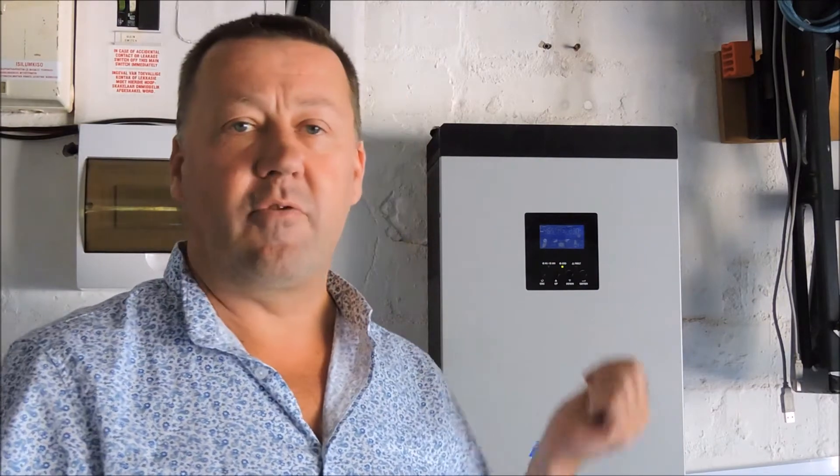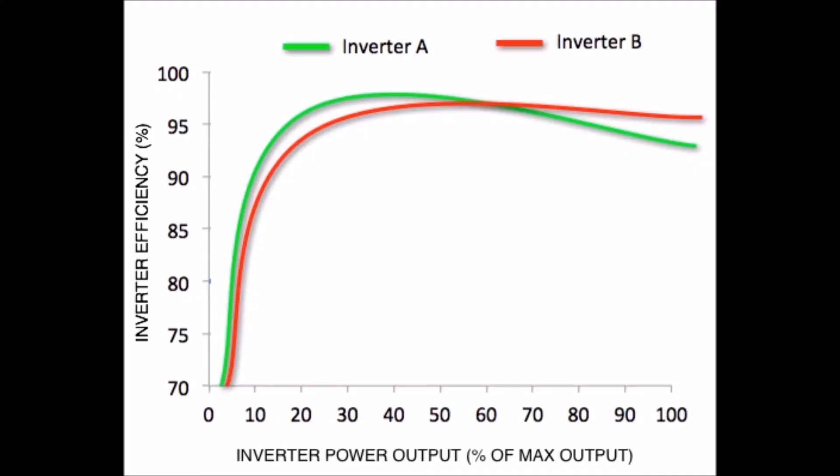The theory is these inverters with very small loads get less and less efficient. While an inverter might have around about 90% efficiency, when it's just drawing a couple of hundred milliamps, that efficiency goes way, way down — it's a sort of exponential curve. I'm going to include a graphic; see at the bottom left how quickly the efficiency ratio drops off.